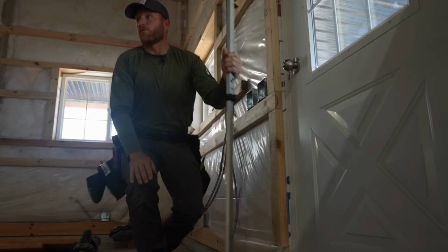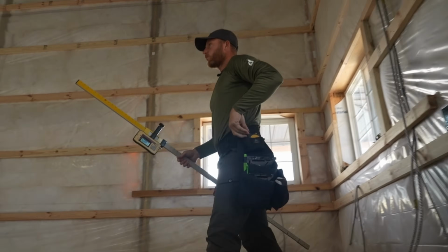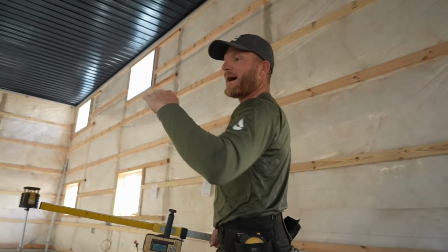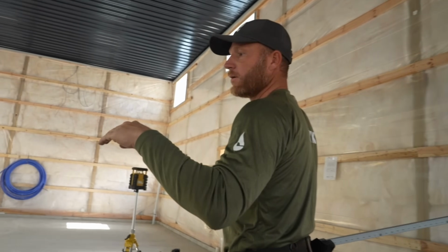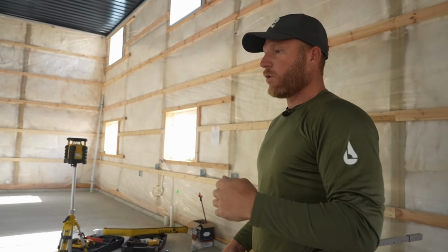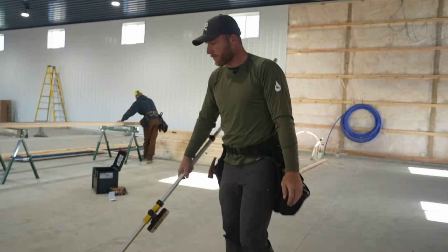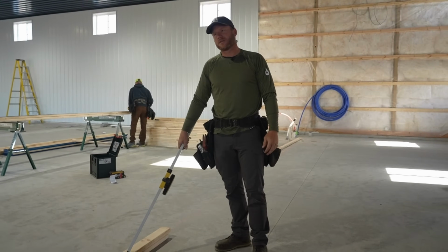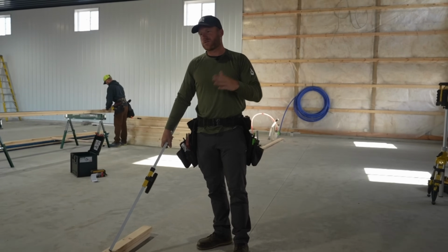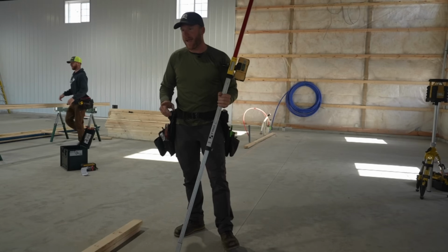Okay, so now that's my zero. I can go anywhere, and I know that I want to be 8 feet above that to the bottom of my ceiling, because it's going to be an 8 foot mezzanine, which means that for my wall, I've got a top plate and a bottom plate. I'm not double top plating this. There's really no need. All my I-joists are going to sit directly on my studs. So double top plate doesn't really add a ton of advantage here,